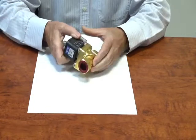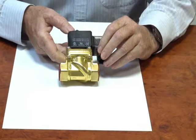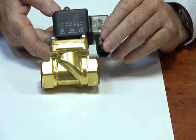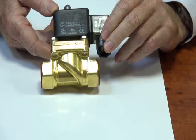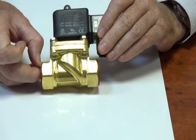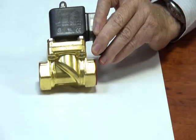This valve is the B55 series. They go from quarter inch to two inch BSP. We use these for our petrochemical and fuel applications. They can also be used in other areas where we have mild corrosive materials or something that might react with other elastomers. The elastomer inside this valve is Viton — it's standard.